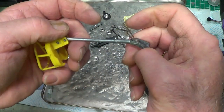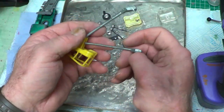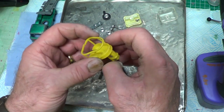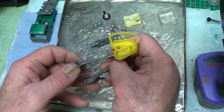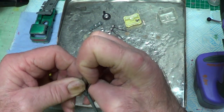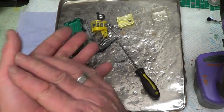A little bit more. Almost there. There, that's not bad. Okay. So that'll need gluing. Those two bits will need gluing, and this piece here, but I'll do that after it's been in the cleaner. I'll just take the split pin off. Have to match it up. Okie doke then, caustic soda bath. See you over there. Okay. In with the boiling water.